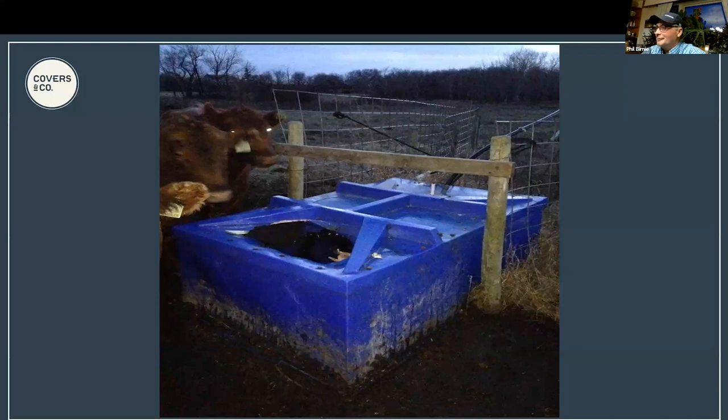This is a very efficient and not expensive system. It's basically like Kellan's float pump system - quoted at $2,750 for a 14-foot lift, which would include one solar panel, a battery box, the pump, and the switch. Switches aren't terribly expensive at about $125, though they occasionally get waterlogged and need replacing. Maintenance on this system has been minimal and it's been pretty foolproof.